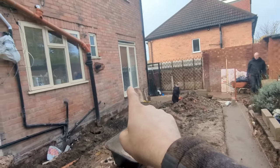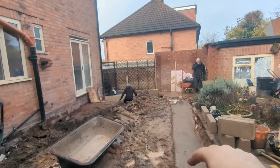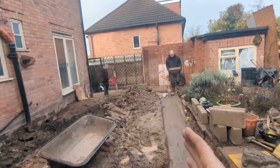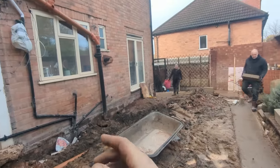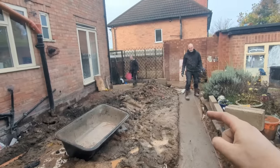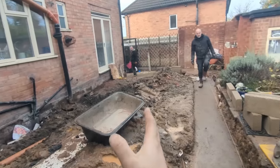So I'm not going to put a line up the gable and then come 90 degrees off that, because I doubt very much by the time we've done that that this line will be square with the house, which puts our roof rafters all in a world of nowhere. So we're going to keep it square here so our roof is right.